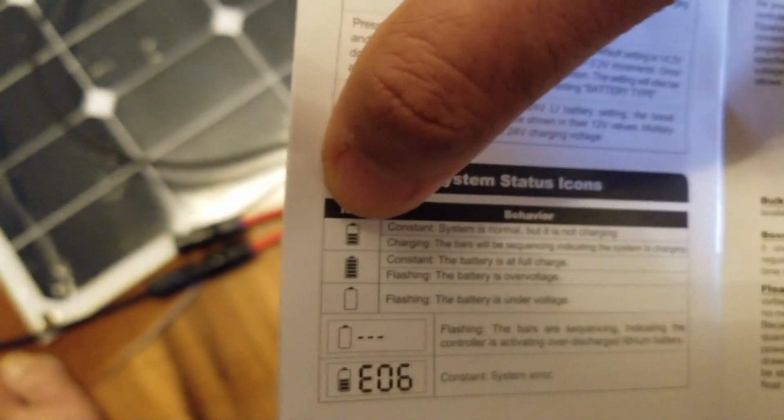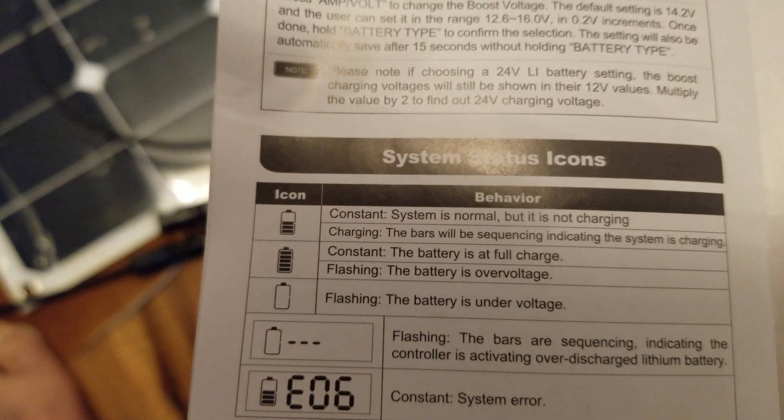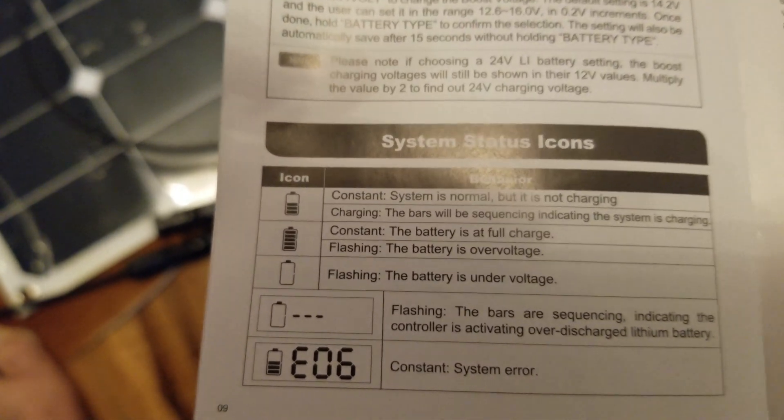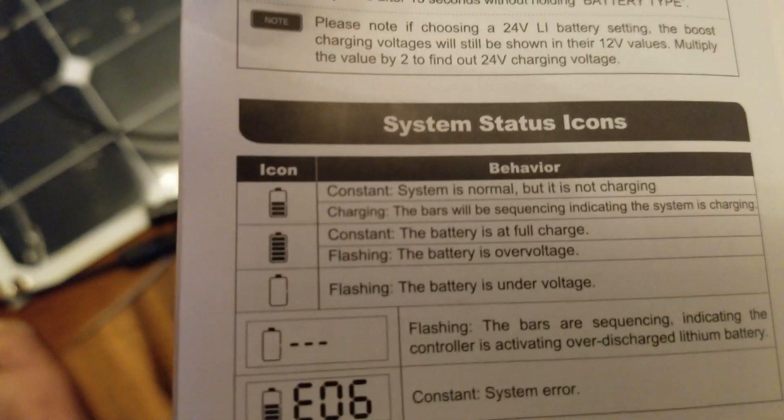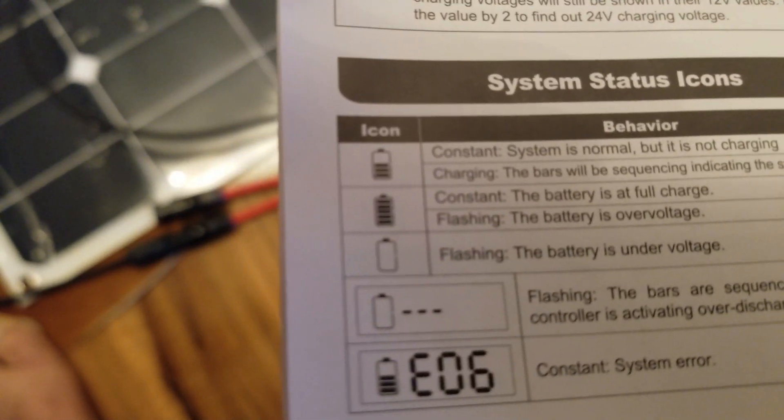It's showing a half-battery icon and I don't like that — it makes you think the battery is at 50%, but that's not true even if the battery is full. I've got a Victron BMV 712 which shows me actual state of charge, so that half icon is absolutely not true — they should have used a different icon. For full charge they show a flashing full icon, and there's an error state. It's a PWM so it's not as efficient as an MPPT, but MPPT is much more expensive.